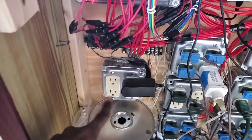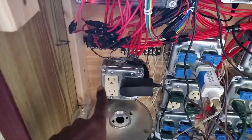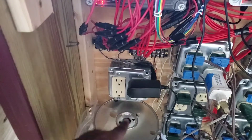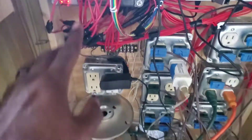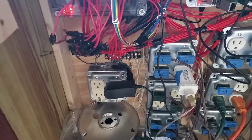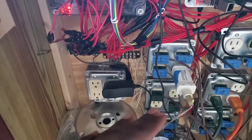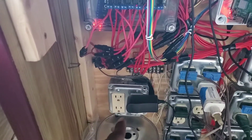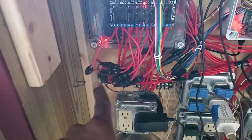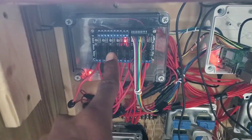I had an additional cord over here, but I took it out for my Tune 2 sign because normally the Tune 2 sign stays lit 24/7. But it kept tripping the GFCI when it rained, so I had to unplug it, and I just took it out altogether to quit having it cause problems with the entire show. The power comes from here to these bus blocks, then to fuses — that's what these black things are in the middle of the red wire.